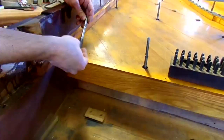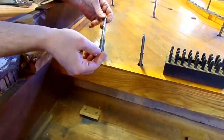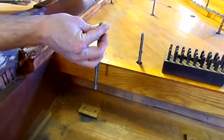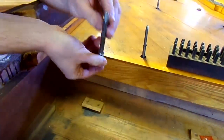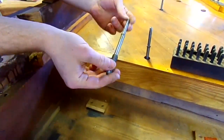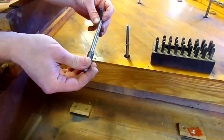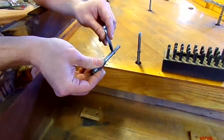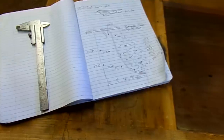Okay, there's the first one we take out. There's no number on it, huh? No, they come out easy. I wonder if they're all the same. You'll see where they were held in a lathe on each end. Still got the lathe mark. Oh, yeah. So we have our little number letters here, because there's more than 10. Tiny little A. It'll go right there. And we'll mark that, so this will go right back. Yep, we mark it over here. The letter. Letter indexing.